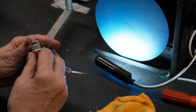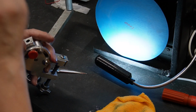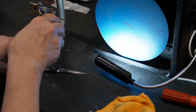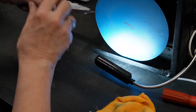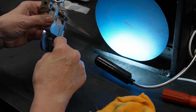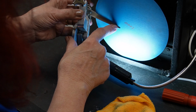The Sam Velas, when they're brand new and they're in good shape, they'll take a 50-degree angle. But I think 45 is as much as I want to do. This clamp, see, rotates so I can get that convex shape. Clamping it on the back rod, have a little tilt down. And this is the area I want to concentrate on.